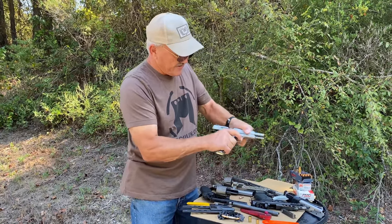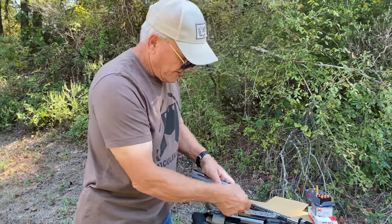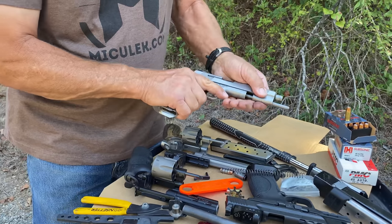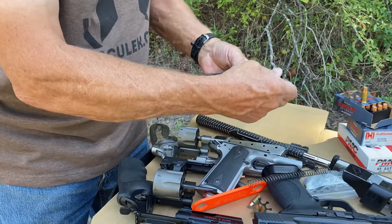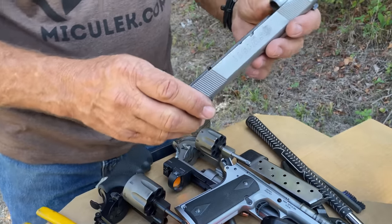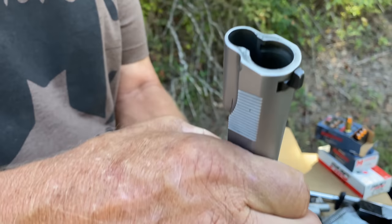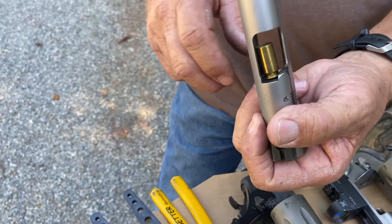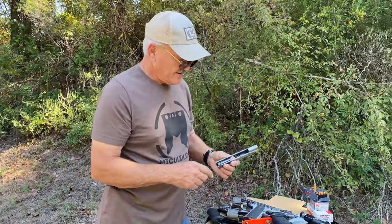We're going to break this gun down right quick. We're empty — let's take it apart and give you a quick look on the inside. John Browning did a pretty good job on this thing. The quality of the extractor: take a fired case, put it against the breech face, slip it under the extractor, and you see it just has enough tension you can feel it — that's pretty good. Anything more than that can actually start to cause malfunctions when the gun goes to close. The quality of the extractor is number one. That's one reason I really like an external extractor on a pistol — it's very easy to maintain, almost bulletproof.